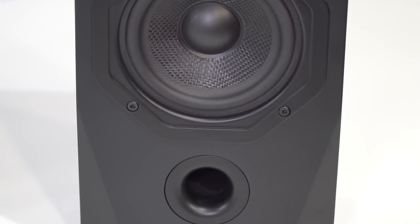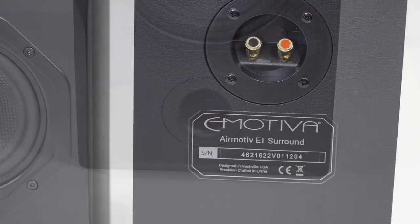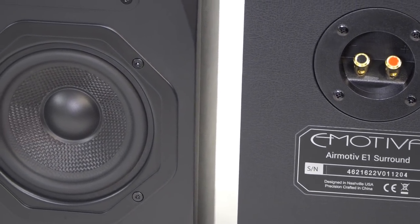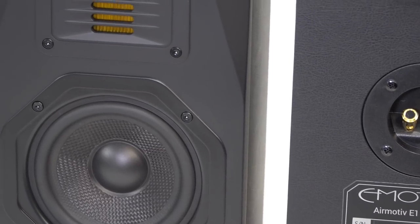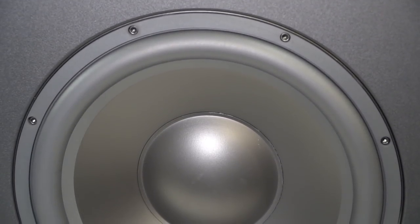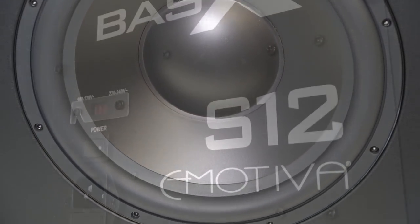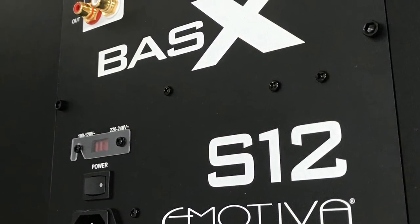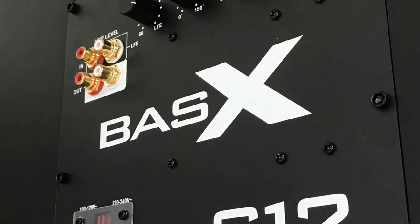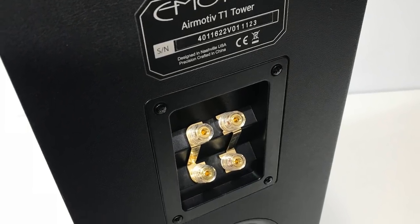While the E1 is clearly not as capable as the speakers used for the three front channels, satellites don't have to carry as heavy a load. The rated frequency response is 65Hz to 28kHz, which is a wide enough range to work with an 80Hz global crossover on all seven speakers. Rounding out the speaker system are the two Basics S12 subwoofers. This model subwoofer offers really great bang for the buck. It digs deep and plays clean, with smooth and powerful output that goes down to 24Hz. And while the S12 does not feature built-in EQ, it's not a necessity, because the MC700 has parametric EQ built-in, as well as fine-tunable bass management.